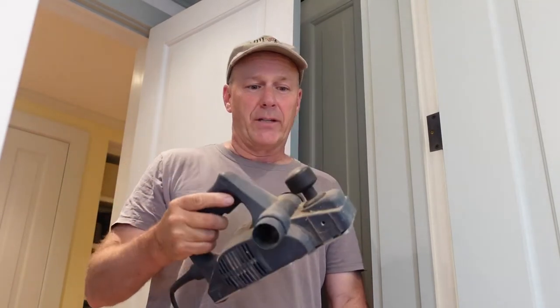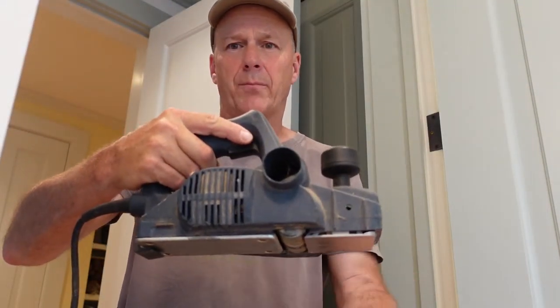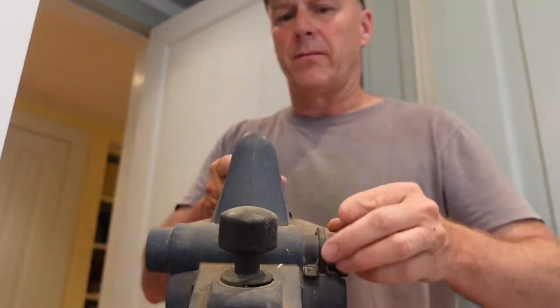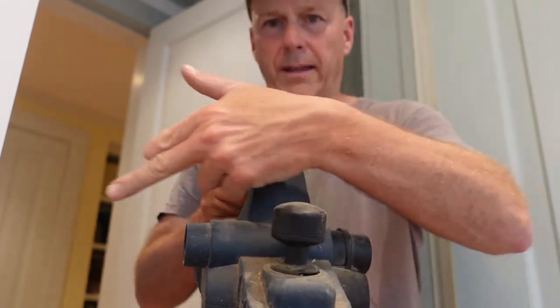There's probably three or four different ways you can approach this. One, you can use a circular saw and measure it and cut it — pretty easy. Two, you could use a hand plane, one of those big old block planes, to take the bottom sections off. That's manual labor, not a problem. I don't have any of those right now, but I do have one of these. This is an electric plane and we adjust it right here with this knob — that's going to raise or lower it. If we raise the front end up a little bit, it's going to cut into the wood and take it off lickety split. This one has two outputs and a button you can adjust to send the discharge either this way or that way. How cool is that?